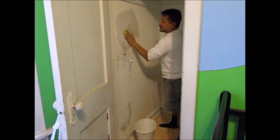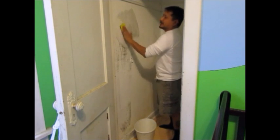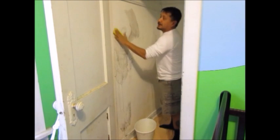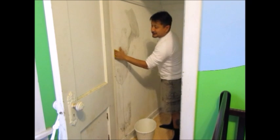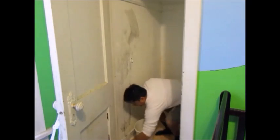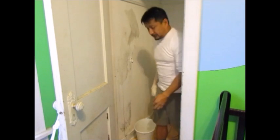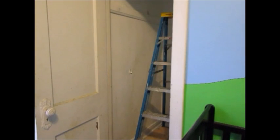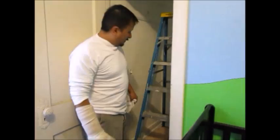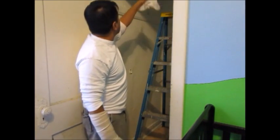I know you're probably thinking I should have a mask on, but everything I've been through in life, this little bit of mold isn't going to get me — my wife would say the exact same things. I put a towel on the floor; you can use plastic. You leave the bleach on for 10 minutes. Even though it looks like you didn't get everything off, leave it a little wet and within 10 minutes it'll dry up and you'll see the mold just fading away. There was some on top that I scrubbed too.